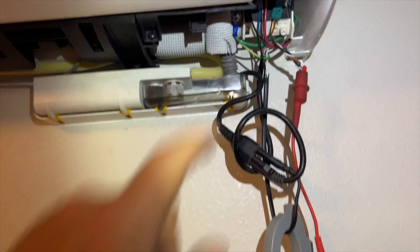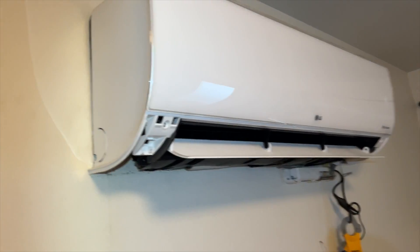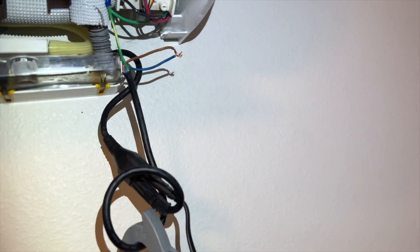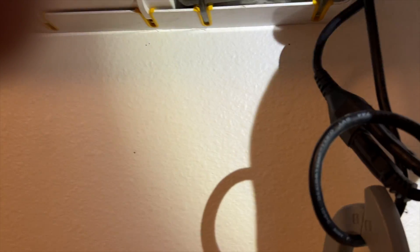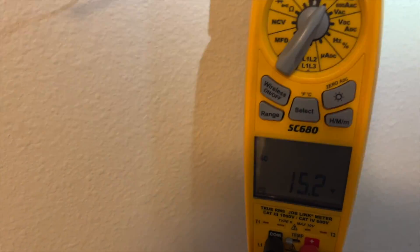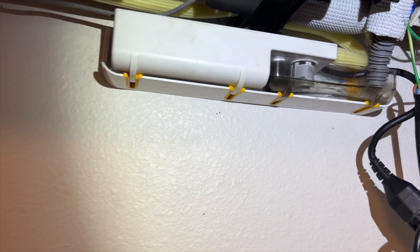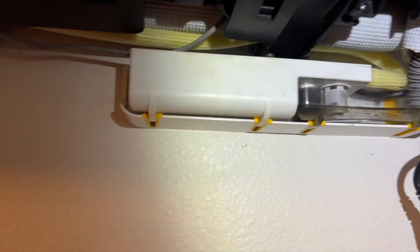I killed the power, got it wired up, and the thermostat kicked back on — unit's blowing air. I've removed the pump and connected everything directly. Checking voltage now — it's fine. So the overflow switch on this pump failed. The pump is pretty nasty too, so luckily I brought an extra one.